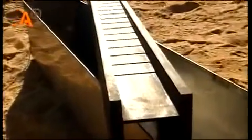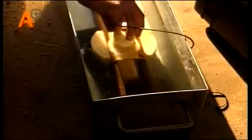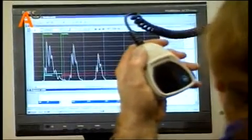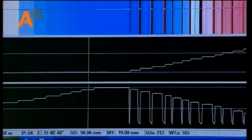Finally, the calibration of the ultrasonic system can take place. We use a stepped calibration piece to set standoff distance and wall thickness. In a liquid-filled tank, one sensor will be moved over this step wedge. These steps will show up on the computer screen. With this information, the ultrasonic system is calibrated.